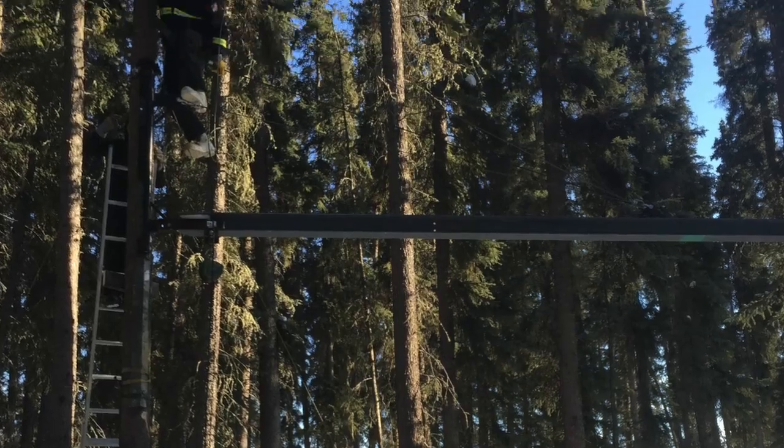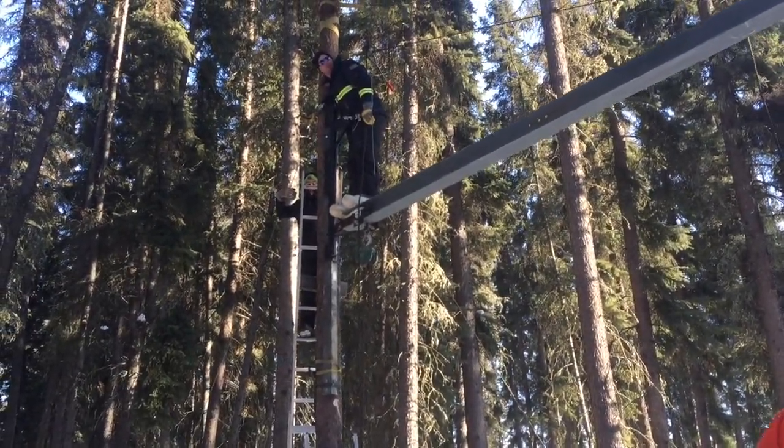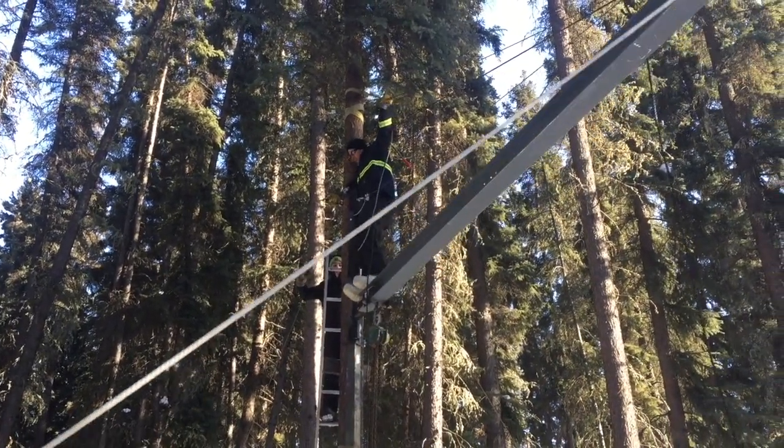To keep the tree from leaning when raising logs, I use cable to back tie the tree to other trees behind it in all directions, so when it pivoted, it was fully supported.